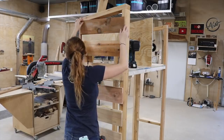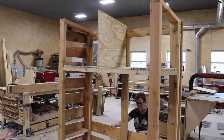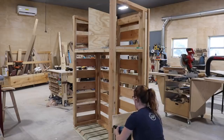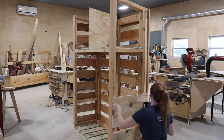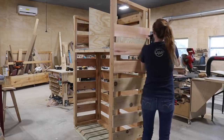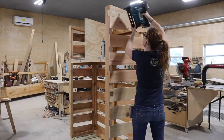If you do this, I would recommend checking for level on your unit before attaching the first slat. Next, it was the same process but repeated with longer cuts on the back and then repeated for a third time over on the second side. I made sure to keep the same spacer to also keep the spacing consistent. When I was in the design phase for this project, I modeled two different versions: the slatted version and a fully closed up version. I was actually leaning towards the fully closed version thinking it would help keep the wood dry. However, I asked my Instagram audience for their opinion and it was pointed out that if I were storing green wood, it would need plenty of air movement to actually dry it out. So that is the deciding factor behind going with this open design.